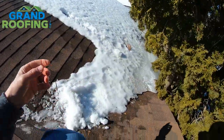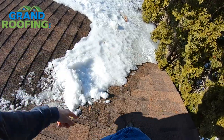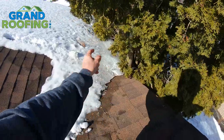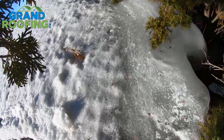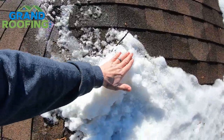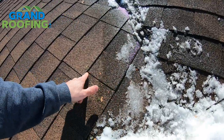Not really a good example today, but the other day I was here and it was below freezing — it was freezing up on the outside edge down here while melting off above. I got in her house, and she's got a closet where Niagara Falls was just gushing in. There was about a four-by-four-foot square with no insulation in that part of her attic. The warmth of her home was radiating through much faster, warming up the roof deck, getting down to the overhang, and causing a significant ice blockage. There's a big block of ice here, and it backs up into a valley — a crucial area.